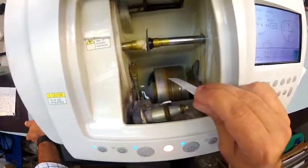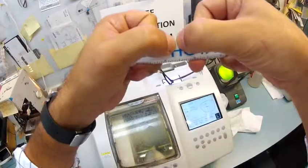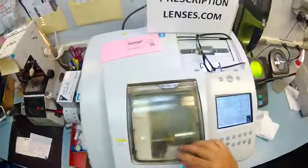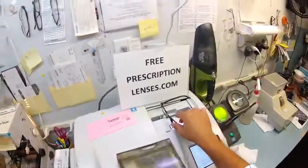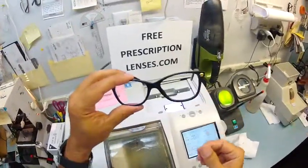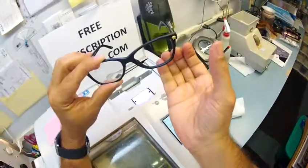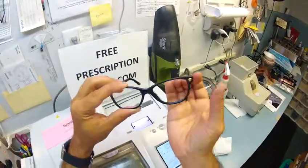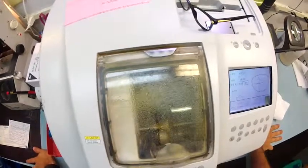This time it's going to skip the cutting wheel and go straight to the bevel wheel, and it's going to take a tenth of a millimeter off. A millimeter is the distance between my thumbnails — I'm going to take one-tenth of that distance off, going all the way around the circumference of your lens until it pops in easy enough. I do not want to force it into your frame because if I forced a large lens it would cause your frame to stretch, or worse — it's known as when your frame rolls. If you imagine this bevel like the gutter on your house, if the lens were too large it would force the gutter to roll outward — just an ugly, terrible cosmetic feature. Because I am a one-man operation, I control the quality of every single lens that comes out of this shop.